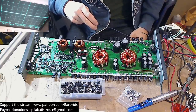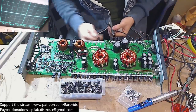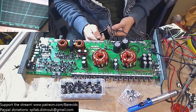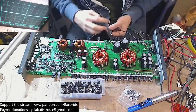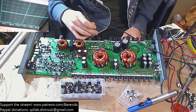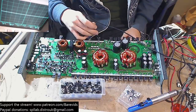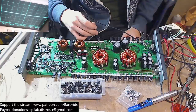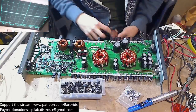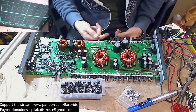Okay, so it's drawing more than 1.8 amps. They're not heating up instantly. This one feels a little bit warm. We didn't get any drive waves whatsoever. Okay, so it is drawing some current. The current is being limited at 1.8 amps, and the input voltage to the amplifier is therefore being lowered to about 9 volts. So.